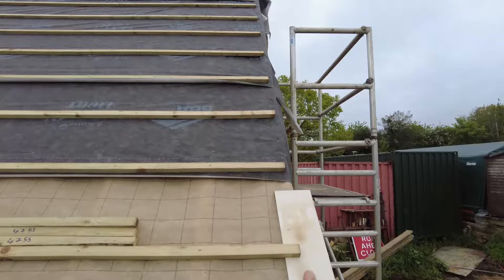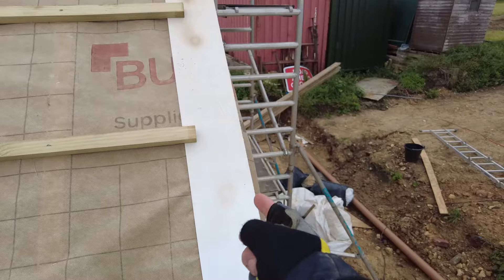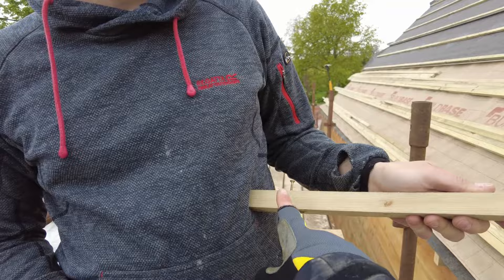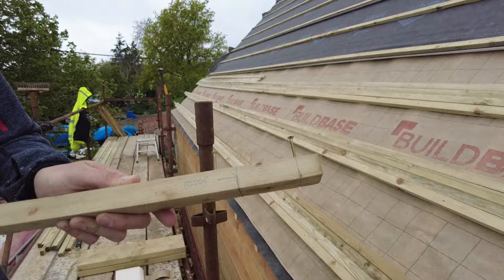I've worked out the tiles that go all the way across, and that means I need basically a 65mm overhang on here. So I'm going to measure off the bottom 65mm, and then at the top as well we're going to string a line. To do that we're using a piece of batten — we screw it to the rafters, and then from the edge end rafter out we string a line, wrap it around. We've notched it here as well.